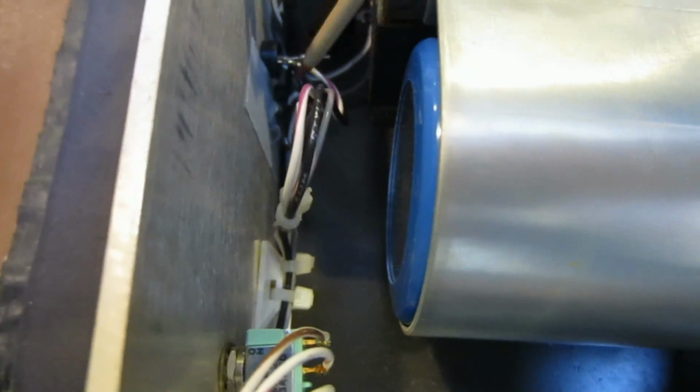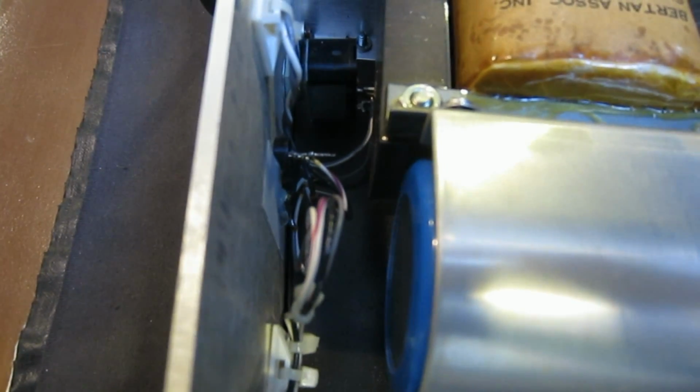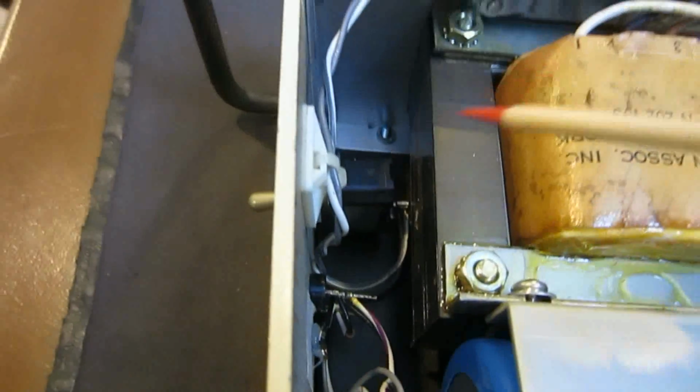One thing I would notice is, I'm not sure you can see, these are the two LED indicators of the polarity, as I mentioned earlier. If you look really closely, okay, let me zoom in a little bit. Here is some insulating pad, and here is actually a transistor. It's tucked right there, glued onto the side, and presumably is driving these indicators.